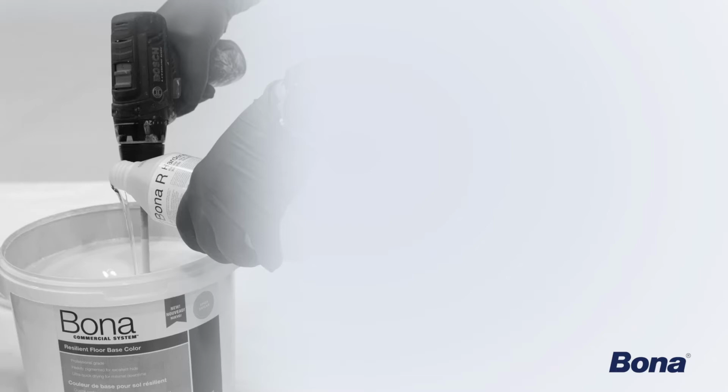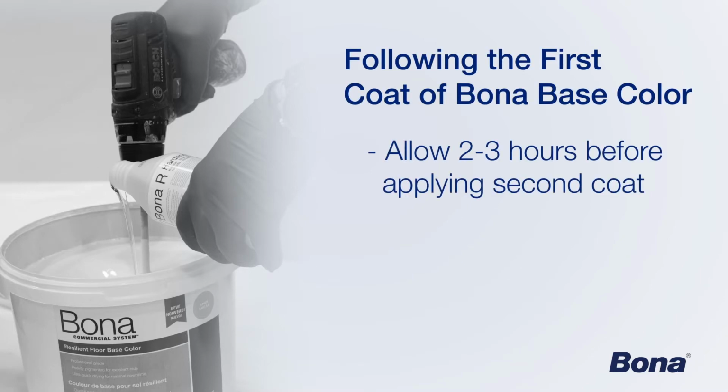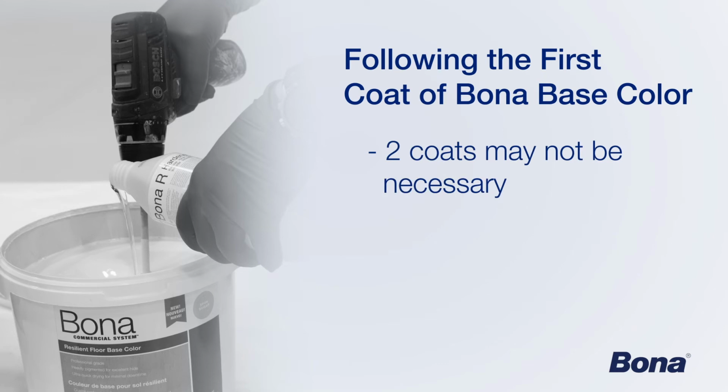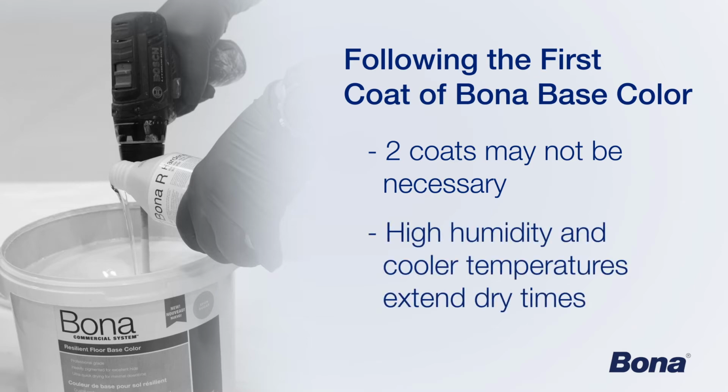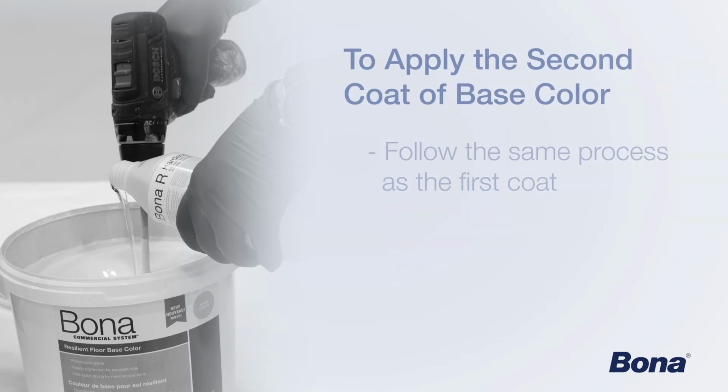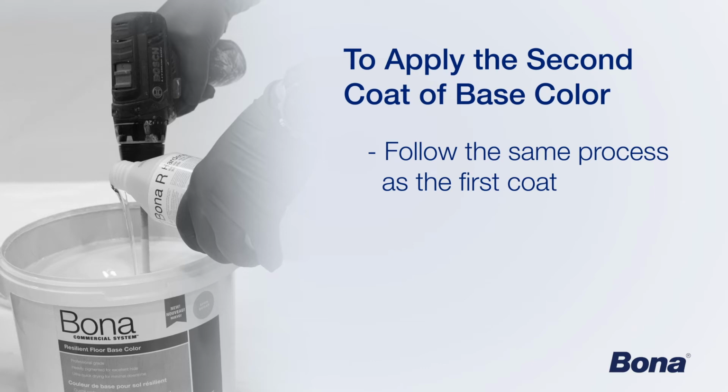Allow the first coat of Bona Commercial System base color to dry for 2 to 3 hours before applying a second coat if needed. Mechanical ventilation can be used. 2 coats may not always be necessary. This will be determined during the floor evaluation with a Bona sales representative. Remember, high humidity and cooler temperatures will extend the dry time, while high temperatures, increased airflow, and lower humidity will decrease dry times. To apply the second coat of base color, follow the same process as that of the first coat and allow sufficient dry time.